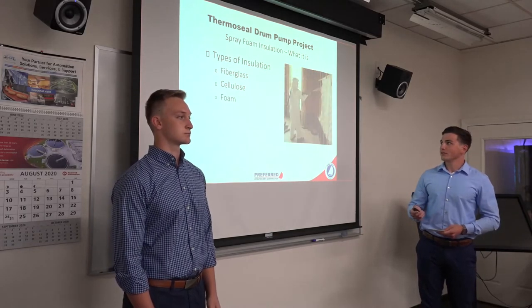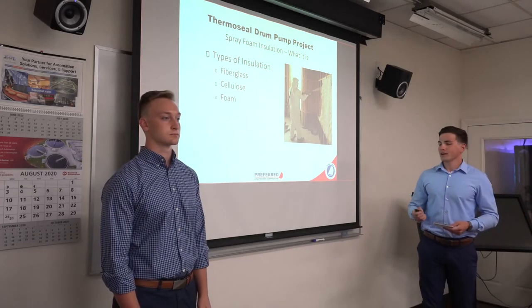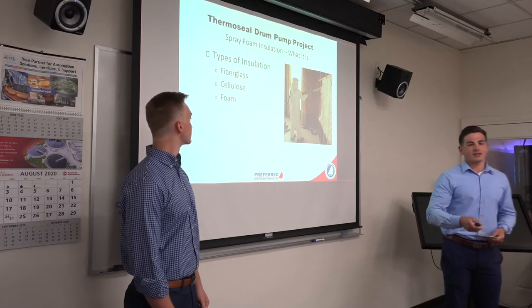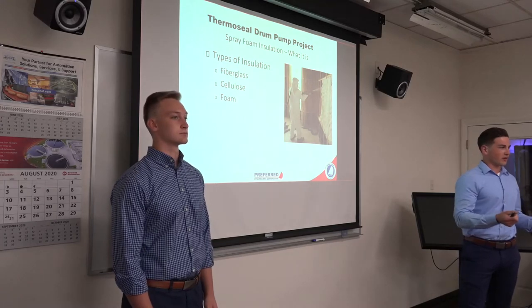And finally, you have foam insulation, which is going to be your most expensive option. However, because it's a liquid and it sprays in between the cracks that fiberglass and cellulose can't get to, it actually does a better job of sealing, and it creates an air barrier which prevents you from losing heat through convection with your house.